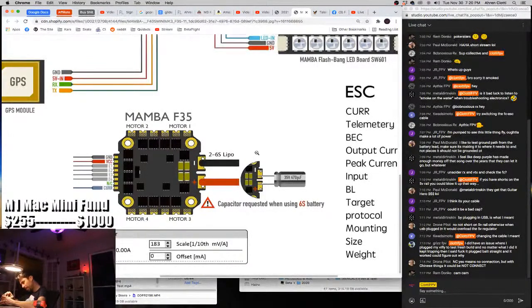Alright, so that plug header is back in there. And make sure it's plugged all the way in. Okay, cool. So that's plugged back in. I really just can't imagine a world where it has anything to do with the ESC, because as soon as I unplug the ESC to flight controller cable, the ESC is totally fine. So it just doesn't make any sense that the ESC is the issue. Let's just start desoldering things from the flight controller.